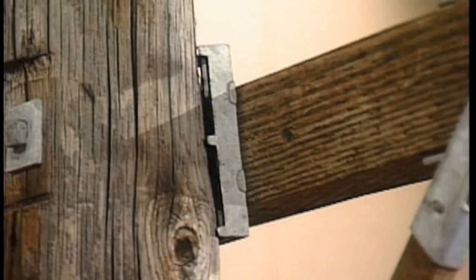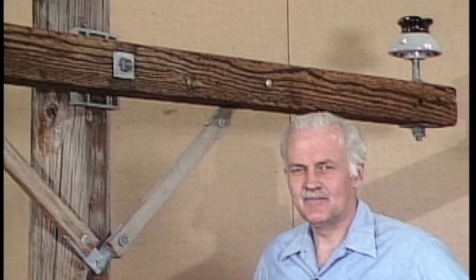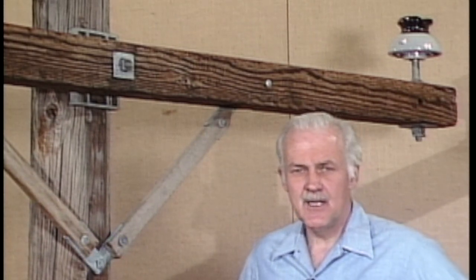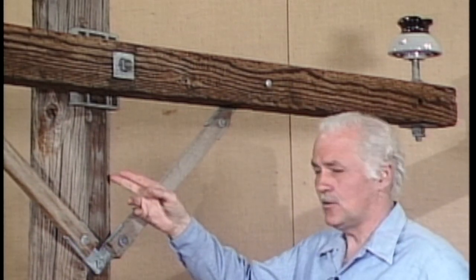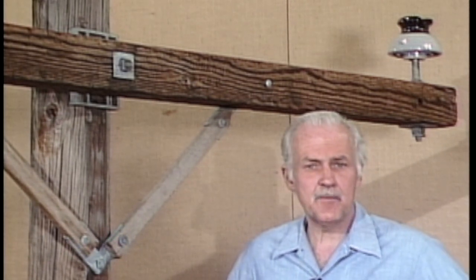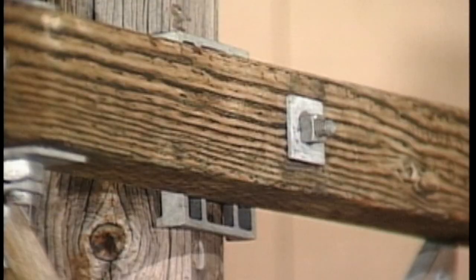Other models also have teeth on the flat side. A patent gain also provides electrical continuity between the cross arm and the pole. If a cross arm becomes energized, current can arc between it and the pole and start a fire. But the metal gain provides a conductive path between the cross arm and the pole to prevent arcing.